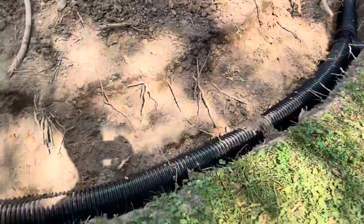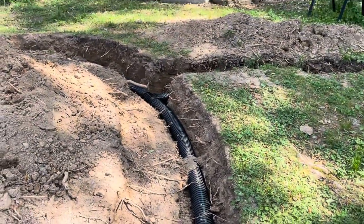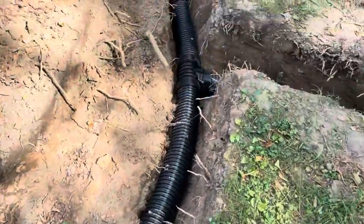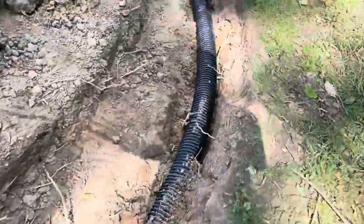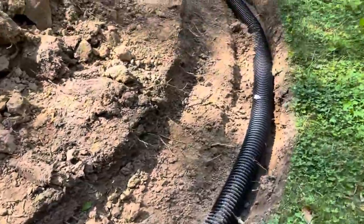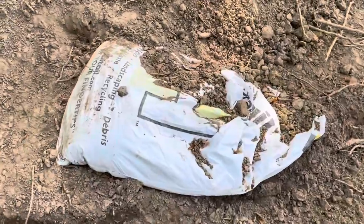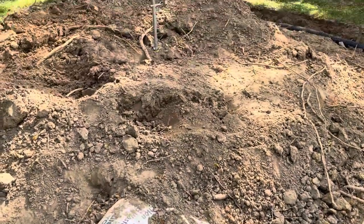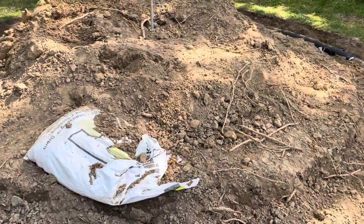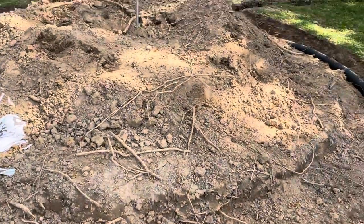Next steps: put the rubble and rock in, then about two layers of bags filled with rock. One of those layers will be toed into the bottom — I'll show you that later. Then the next step will be filling up these bags with the soil that's on this property. It's the perfect soil mixture: 30% clay, 70% sand, and that's gonna be perfect for what we're doing here.